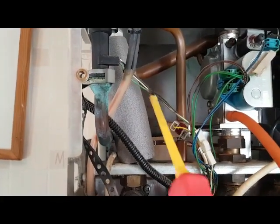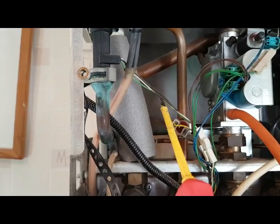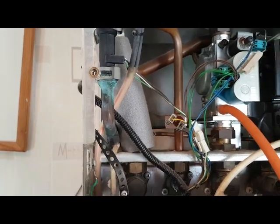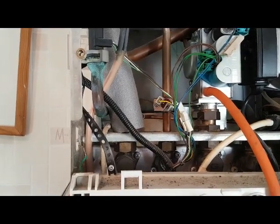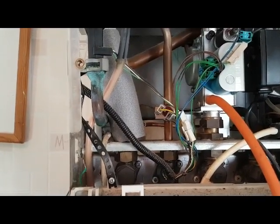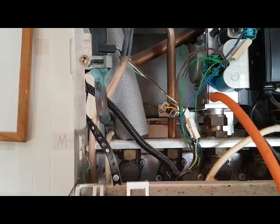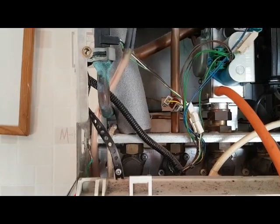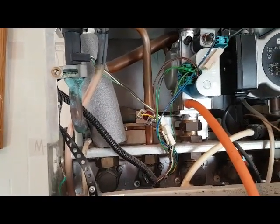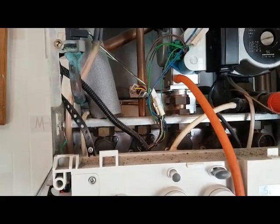You can check this by checking the voltages on this cable. There are three of them. One gives a constant voltage — it's very low, only about 5 volts DC. When it's working, the return wire will give a reduced voltage of about 3 volts. The PCB will pick up this drop in voltage and then it will start the activation for the hot water. That's how you carry out the test.